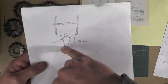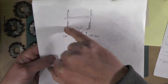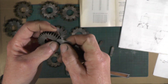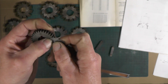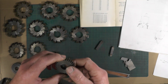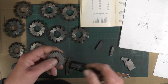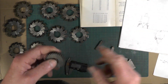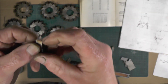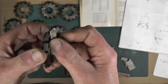I'm looking for a half-inch diameter grindstone. You'll need a magnifying glass to check this because you need to be as close as you can to that tooth form. I'm over on my Myford lathe making a grindstone of half-inch diameter — I'll show you how I'm going to cut a grindstone to get the correct form I want. When I've done the grindstone it will give me a form very similar to an involute gear cutter.